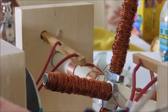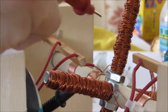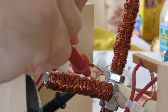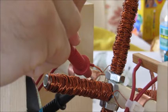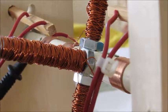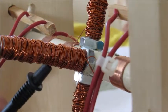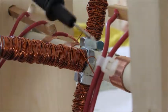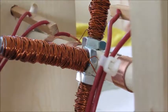You put the two ends together and do a sound test — this slip ring to that slip ring, to the actual coil itself. You can see there's a connection between the slip ring and this wire, which goes up and around the coil. You need the slip ring connected to your wire, and there you go — connection between the actual wire and the slip ring, making sure the brushes are touching where they need to touch.